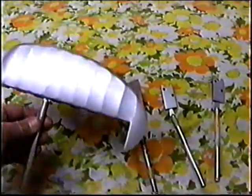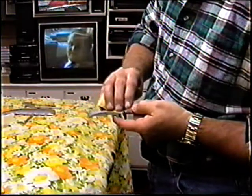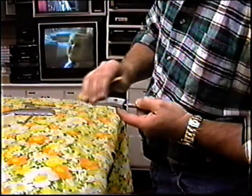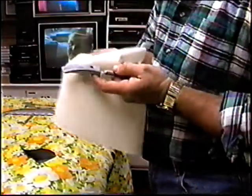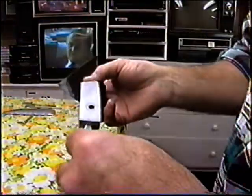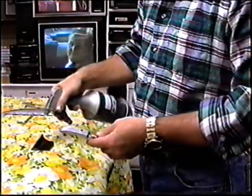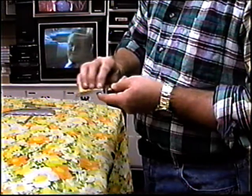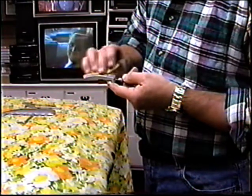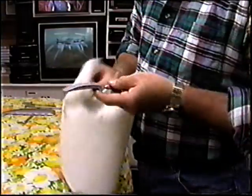That's why it's always good to have some little parts to do your testing on. Now, I always like to do a quick test. Again, this is what the throw parts are for, because now we're building up a relatively smooth finish. The way you always tell if dope is ready to sand, and this is legitimately 9 hours old, one of the things you can see is it's coming right off, and it's not turning to chewing gum. I would ask the people down at Randolph, since they're right down the street from my house, what is the minimum time to sanding? They may not really know, but I know for sure this is ready to sand, so I'm going to get busy and possibly get this sanded out, or parts of it, today.